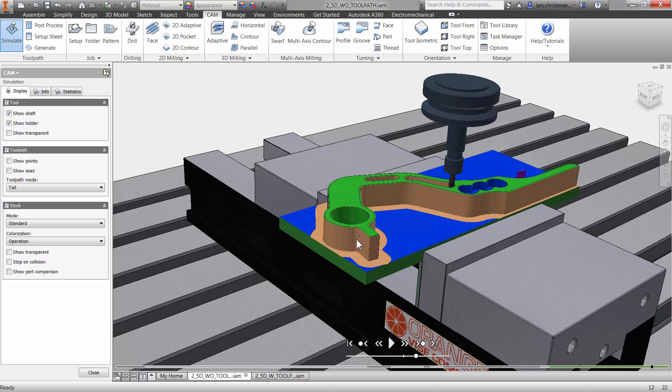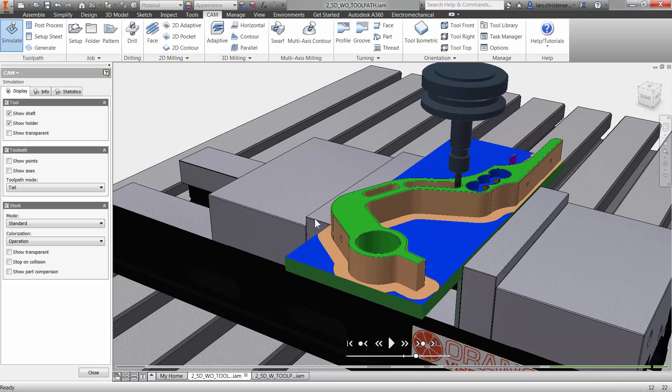I could take the two steel jaws on the vise, take them off, and put on the aluminum ones I machined. Then I could actually machine this shape right inside of those jaws so I could hold it securely — almost like doing a boolean operation, subtracting the shape out. That's an Inventor job more than a CAM job, but the nice thing about being inside Inventor is you can draw up custom jaws, subtract this shape off, machine the jaws right inside the vise, and the part fits in nicely.